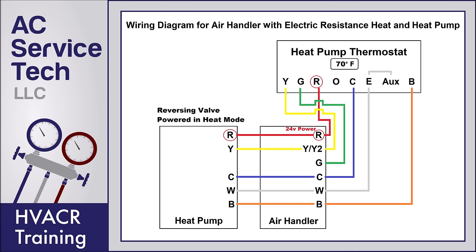When you turn the heat pump thermostat up to 71 degrees with a B terminal system, the R terminal connects to the G, Y, and B terminals. You're going to have a 24-volt signal on G, Y, and B at the indoor air handler, which then goes out to the outdoor heat pump. The Y terminal powers the compressor, and the B terminal powers the reversing valve to turn the heat on. The reversing valve is powered to reverse the refrigerant flow direction in order to reject heat inside the building instead of absorbing heat.